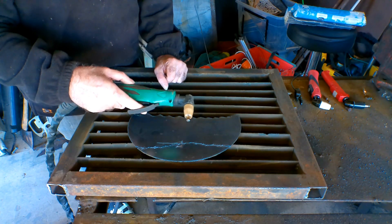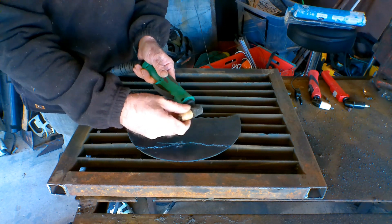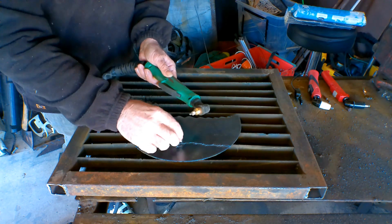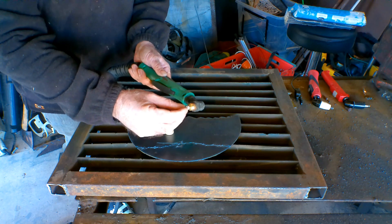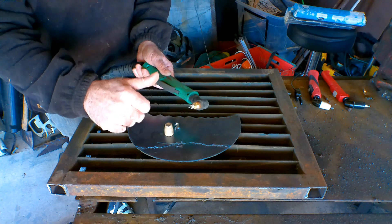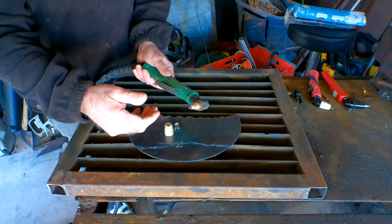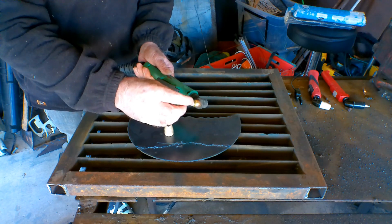Well, it winds me up anyway. So before you go and pull your plasma cutter to bits because you think it's buggered, just check your consumables real good. Check that your swirl rings are okay and check that you haven't burned out your consumables. I've got another video on swirl rings and ceramics, so check in the description below. That goes into a little bit more depth than what I'm doing here. So we'll figure out first that all this is alright.